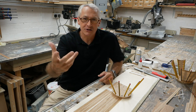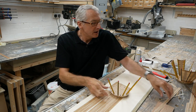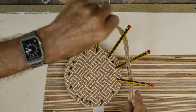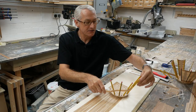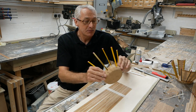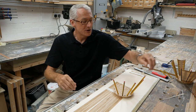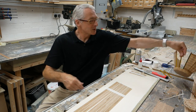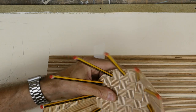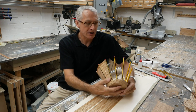It's right about now that things start to unravel a little bit. You're probably already there because you're way smarter than I am. What I forgot to account for was when the pencils go into the base like this, obviously they go in at an angle, and no matter how thin a strip of bendy plywood you have — and these are all sub-millimeter — when you start feeding this through, because of the angle, it makes it really hard to get around. Not only does it start to break and crack, but it actually just doesn't look very nice. So yeah, a bit of a fail on my part, which is why we find ourselves switching quickly to Plan B: to clad the pencils in little plywood panels like this. I actually think it looks quite nice with the black of the pencils showing through.